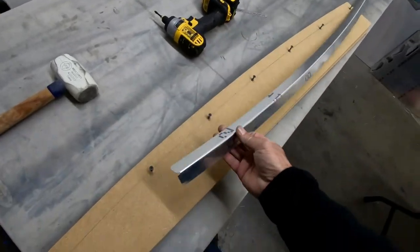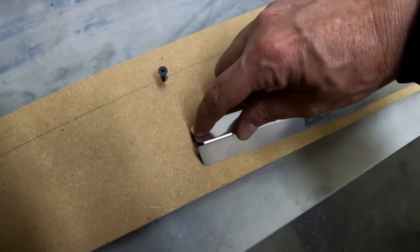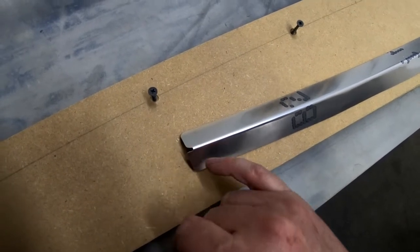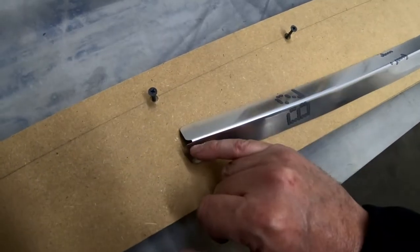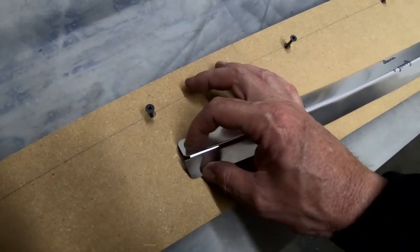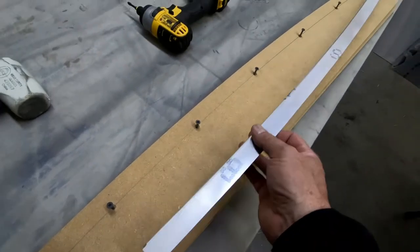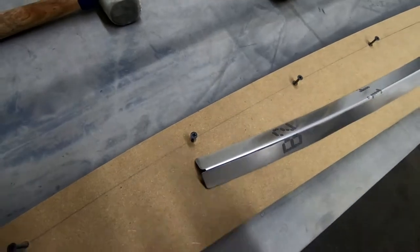side did. On the back side here, I do have to cut into here a little bit to make this 12 millimeter flange that needs to be bent on the end here that goes against frame 7. My 1/8 inch router bit won't quite cut all the way into there because it gets a little bit too narrow, so I'll take a Dremel tool with one of those fiber disc cutting bits and cut this back a little bit more, and then I'll bend over that 12 millimeter flange there. Once I do that, I can fit this in there and start the drilling process. I don't see why this isn't going to fit just as good as the left side, so I'm going to keep working on this and start drilling the holes in place.